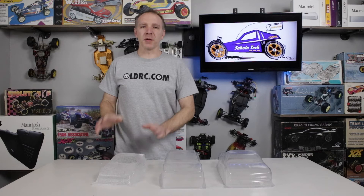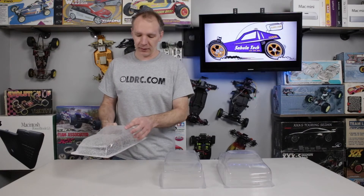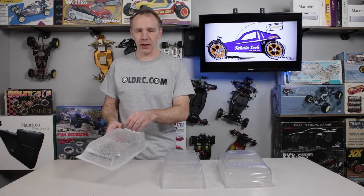Here are some bodies that all have symptoms of drying not being done properly before they were run. This one is an example of one we actually did many years ago — the very first mold we ever ran on our equipment. It's a very extreme example: a combination of it not being dried plus the heat was on too long. There are huge air bubbles in this plastic because the moisture is turning to vapor and causing all these air bubbles to form.